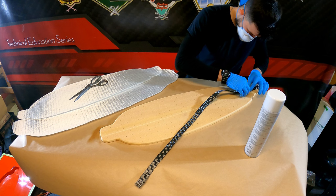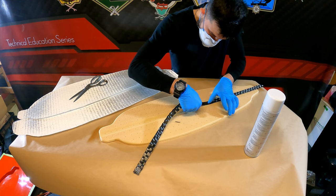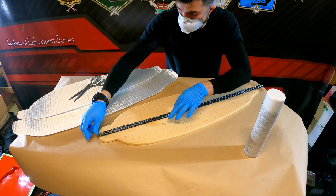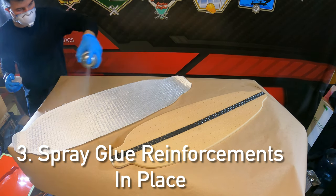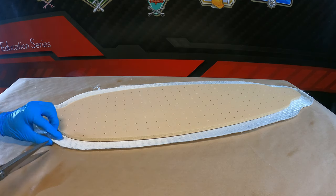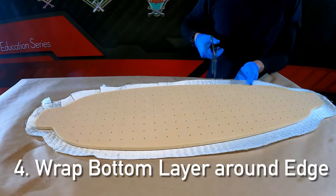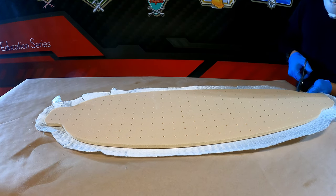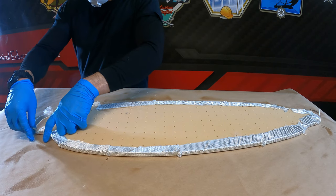Once we have our skins ready, we're going to use some spray glue to hold our reinforcements in place. This is one of the nice things about infusion — it allows you to be really precise and get things right where you want them before you mix up resin and start trying to wet things out. He's got that carbon strip spray glued down the middle, and now he's spray gluing the bottom skin. Go sparing with the spray glue — you don't need a lot, just enough to hold everything in place. He's placed the core on top and is now cutting darts to allow him to wrap that fiberglass skin around the core, which gives the edge strength and protection.